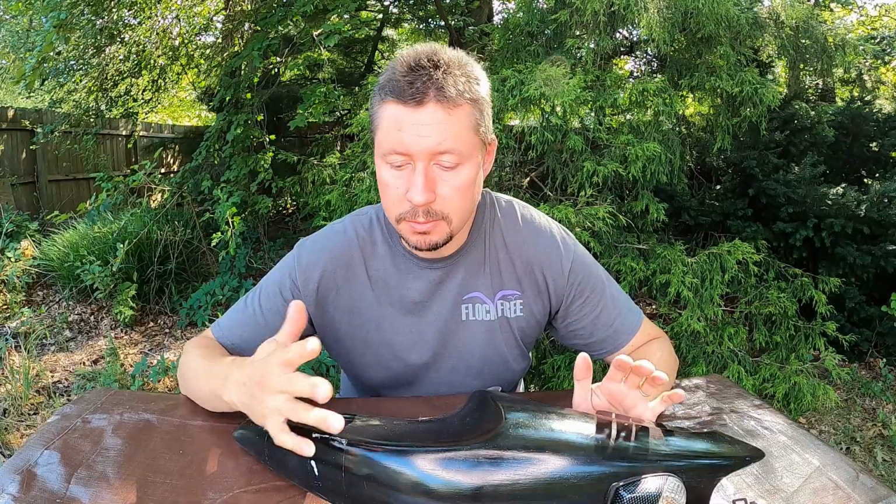But before we start, I'm going to explain what I'm going to do. I am not a professional painter, but I have some experience from my previous projects and I can tell what you should do and shouldn't do. So there are two main ideas behind preparing for painting. The first, you want to get a flat, even, smooth surface. The second idea is that you want to get some kind of surface allowing the particles of the paint to bond with this surface.